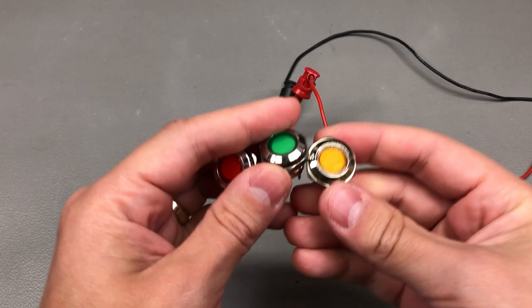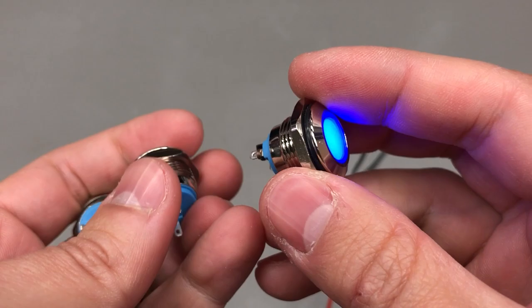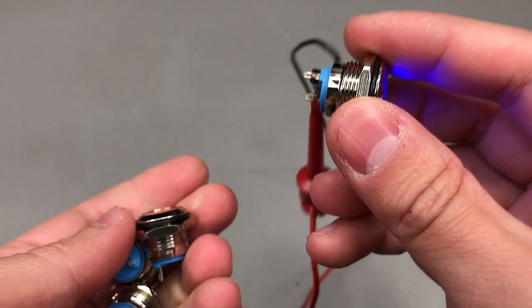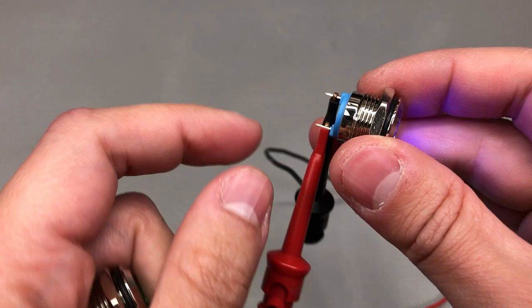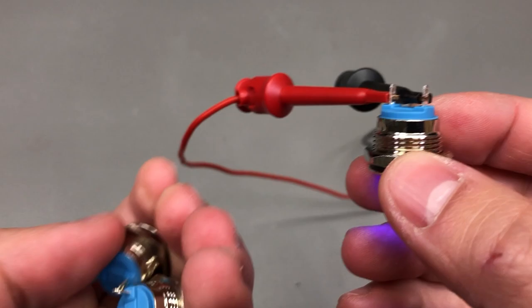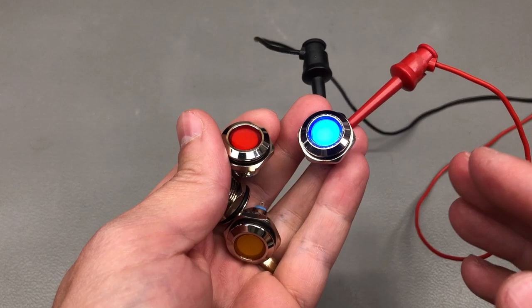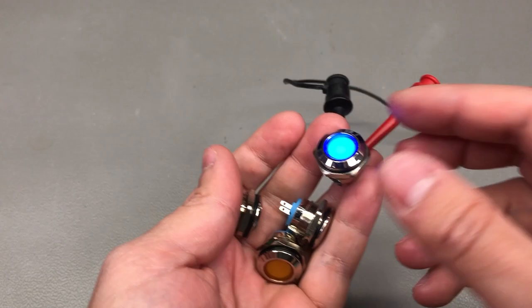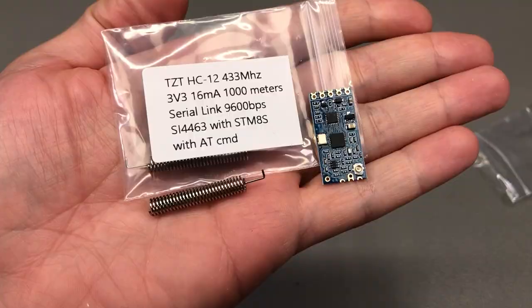Next up I ordered a set of metal panel indicator lights. These are not switches — they are just panel lights with a metal case, available in different colors. They require a 16mm diameter hole for installation and come rated for different voltages from 3V all the way up to 220V. They work on both AC and DC, so they must have a rectifier bridge inside, because it doesn't matter which way you connect them — they will still light up. They're also rated IP66 waterproof. I'm actually building an activity board for my toddler and I want to integrate a few of these lights. Let me know in the comments if you'd like to see a video presenting that activity board.